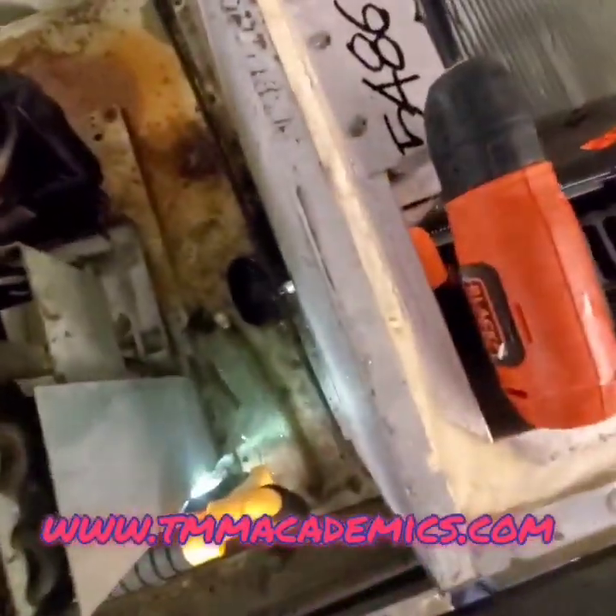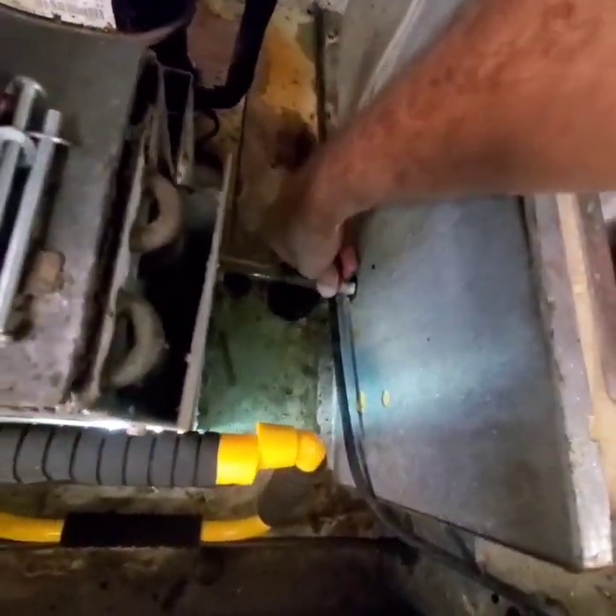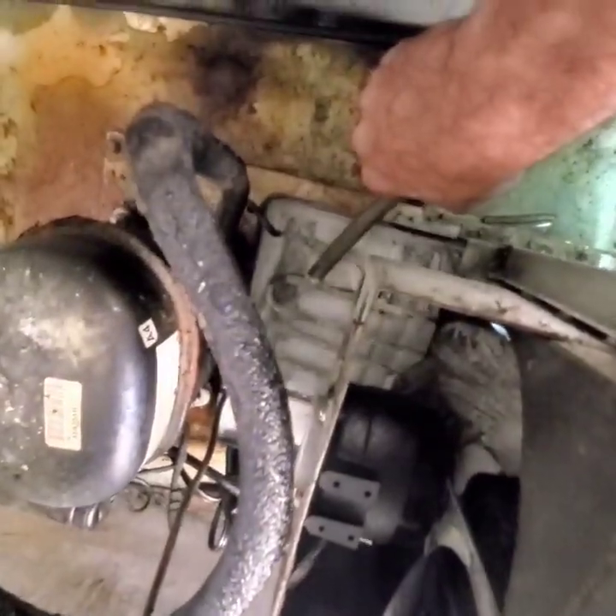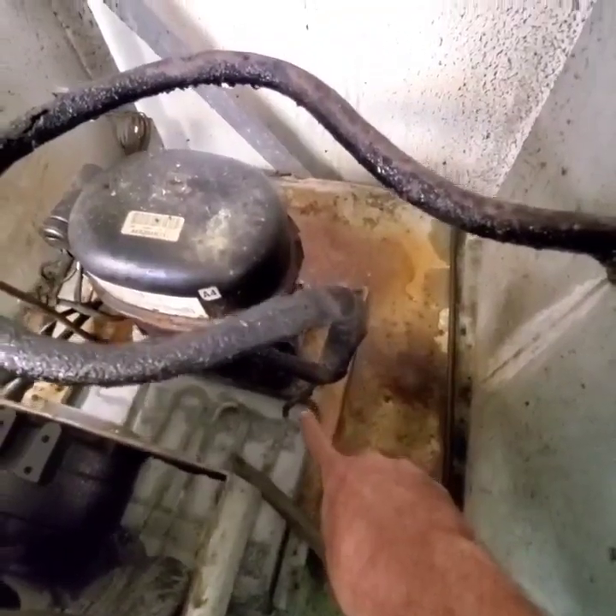So you see how it's leaking? That means I know I don't have any obstruction and it's going to drain out all of that water. But we don't want it to drain out on the roof of the box, so we're going to let it go into that condensate pan. Those coils come off the compressor and they heat up that pan to make that water evaporate. Once you steam all that out, put the box back up and button up the unit.